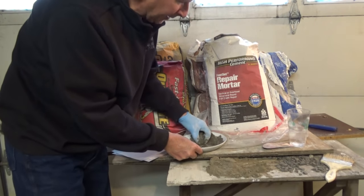What do I use this for? If I'm making a small sidewalk I'll get 10 bags, mix it up, and put it in. I can also mix it with slow-drying — they don't say to do that, but I've done it and never had a problem. I use it under pavers, for a barbecue area, or a paver sidewalk — mix it up, dries real fast in summer, put the pavers on top, done. I've made wall caps out of it. But if you want to see how I patch something, go to my concrete patch videos — you'll rarely see me using this because the rocks get in the way.